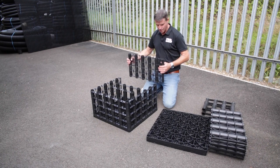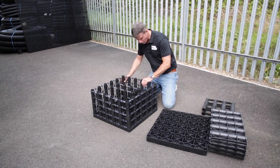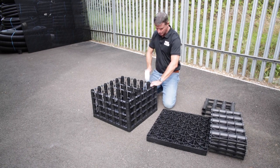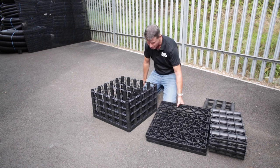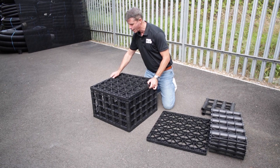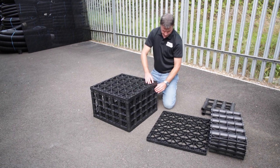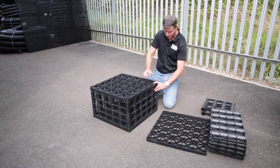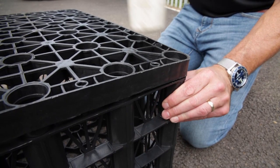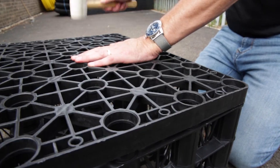Finally we put our last piece in and you see the mitre there lines up with the corner piece. We'll just tap them down gently into place. Now if there is a fiddly bit, it's this — we're putting our top plate on now to make our single. What I tend to do is just pinch the mitre in on the corner, just to make sure that's exactly as you want it, then give that a tap down.